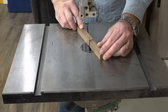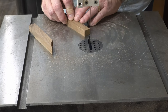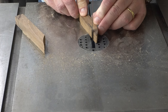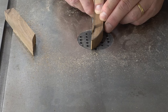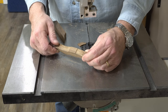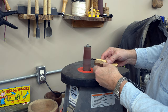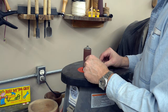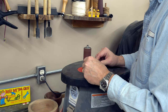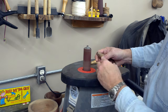I started my cuts on the side of the small block following the curved handle lines. I went slow and had to make a few small relief cuts as the bandsaw blade was too wide for really tight turns. In the end, I wound up with a nicely rounded blank that I could work with. I decided to do all the rest of the rough shaping on the spindle sander, which works really great for smoothing out the inner curves, though I also used it for rounding over and shaping the outer curves as well.